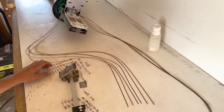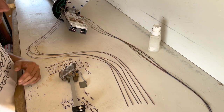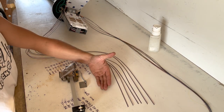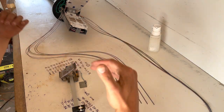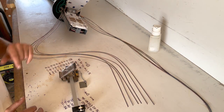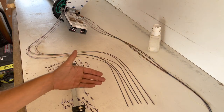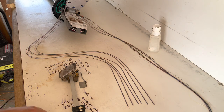Just always make sure to measure fiber to chip before you start ribbonizing. If you don't measure, then you ribbonize all these, then you go to splice them, get them all spliced, you go to put them away, and it does not fit in the tray. So just always measure first, then get the ribbonizing done that you can splice.